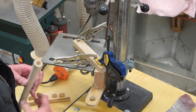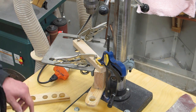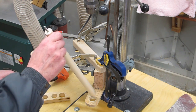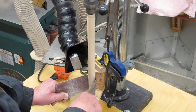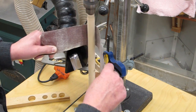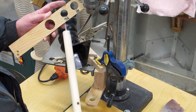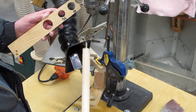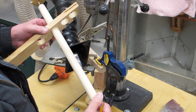So you rough sand your wooden pipe down to a fairly even diameter on the lower end. Make up some type of jig or fixture on your drill press — drill a hole in it that'll serve as a bearing for the lower end. That's just going to stabilize this bottom end so it doesn't chatter around. You can pull a little pressure against this to sand it even.